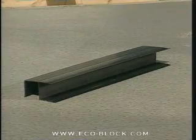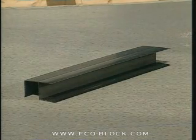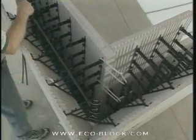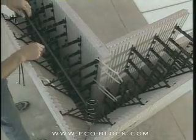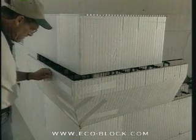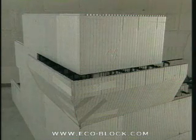Using a 90-degree corner connector on the inside of the BrickLedge corner will ensure a tight seam and eliminate the need for additional lumber bracing on the inside of the form. The work on the inside of the form is finished by inserting the BrickLedge rail in the standard way. The outside of the corner gets reinforced with strapping tape. If you see any gaps in the cuts, fill them with urethane foam.